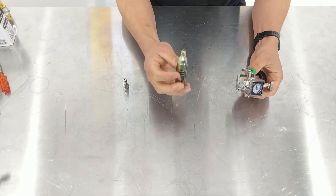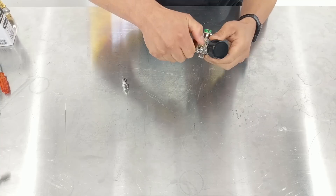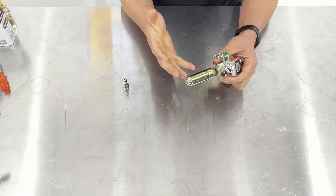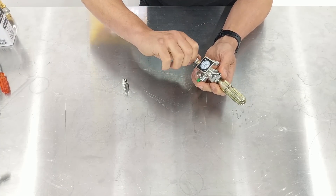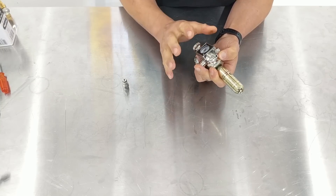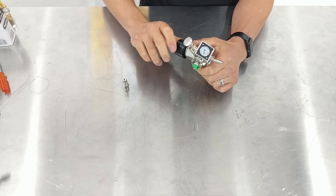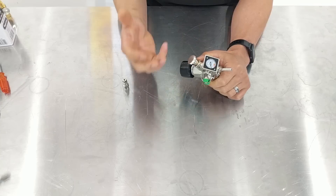Here's the moment of truth. I've got this little 16 gram bulb and look at how easy it is to couple. I just screw that in the underside here, making sure the pin is screwed all the way out in the anti-clockwise direction, and I've also got the regulator knob out as well. I screw this in just until it's hand tight and firmly against the seal. As you can see, no gas is leaking out anywhere. Then I screw this core depressor or actuator pin down and there's a little bit of resistance — you might be able to hear it. The gas is coming from the cartridge and filling the body of the regulator. So now this thing's ready to go, and if I screw this knob, you can see I've got perfect control, no wasted gas at all — much easier to couple and a much more reliable connection in general.